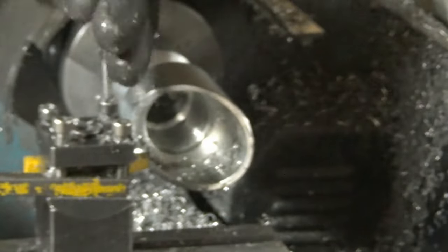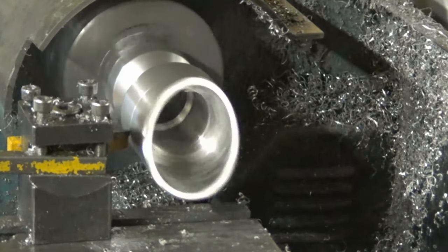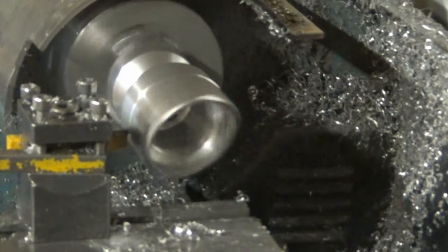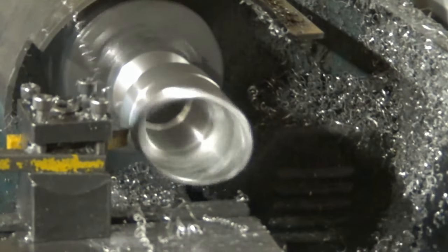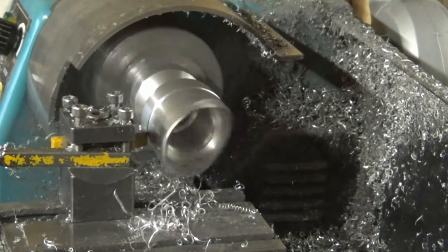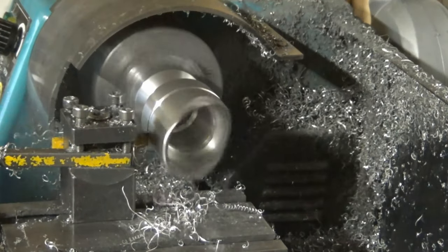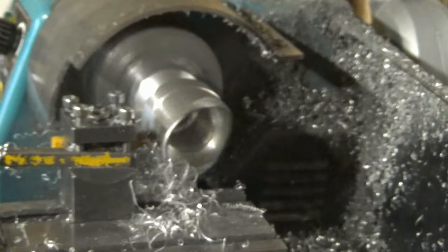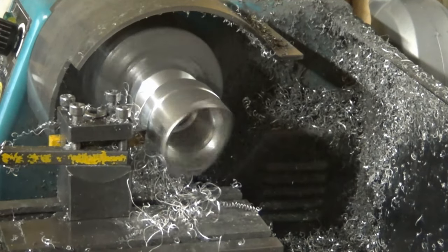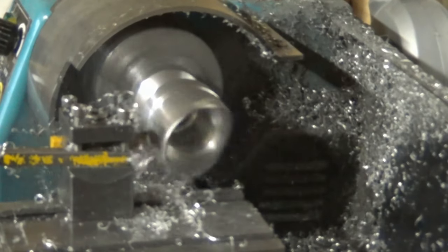So the internal diameter of that emitter now accepts the new part I've made. Because of the shape and length of this part, I couldn't use the mitre saw — which was my preferred option — to cut this section off. I had to do it on the lathe. I have the cut-off tool for the lathe but my lathe absolutely hates that tool, so I have to effectively cut a big groove and work my way through the metal at an angle, making the groove larger and larger.